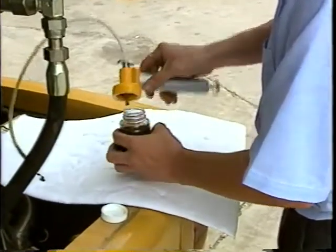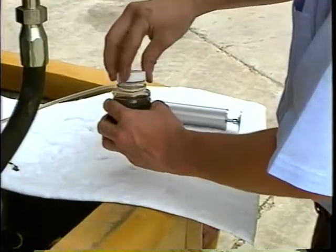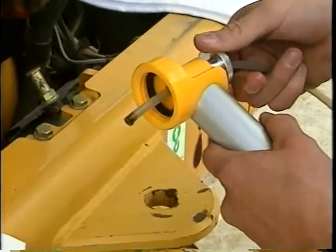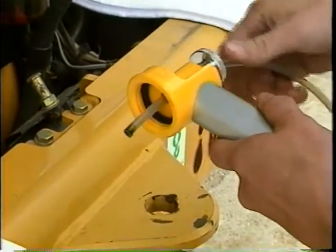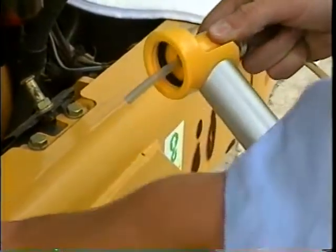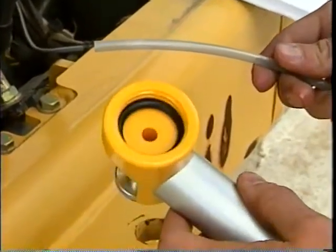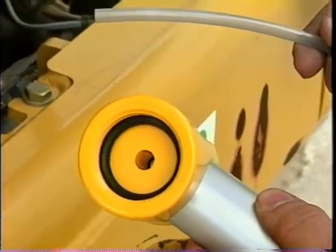The outside of the tube and the underside of the vacuum pump head should be free of oil. If the outside of the tube comes in contact with the oil, loosen the retaining nut and extend the tube through the vacuum pump — this enables you to trim off any contaminated tubing. Then the tubing can be retracted. This minimizes the oil contamination that builds up inside the vacuum pump. If you don't do this, future samples taken with this vacuum pump may become contaminated.